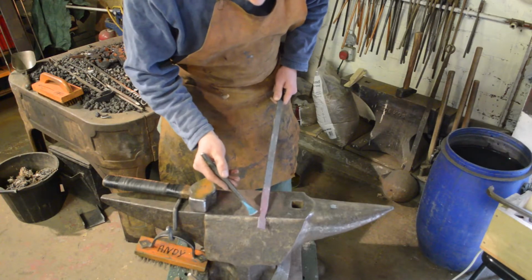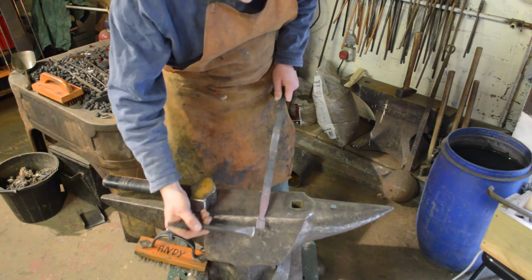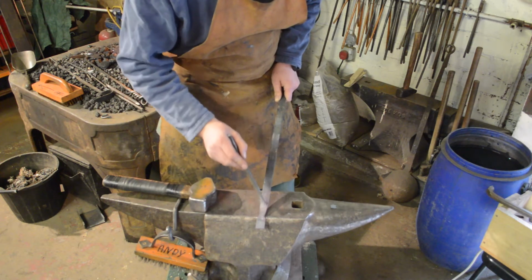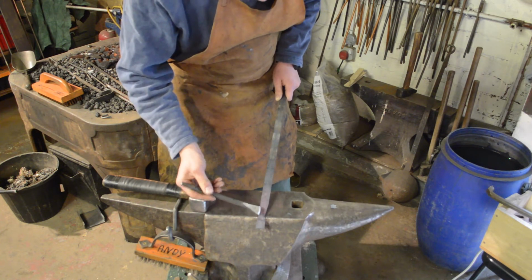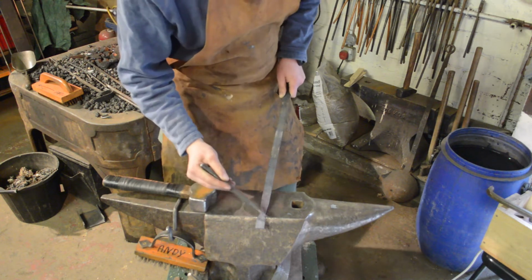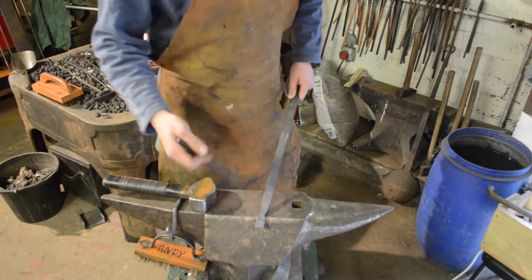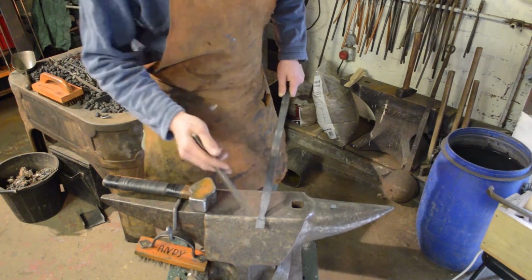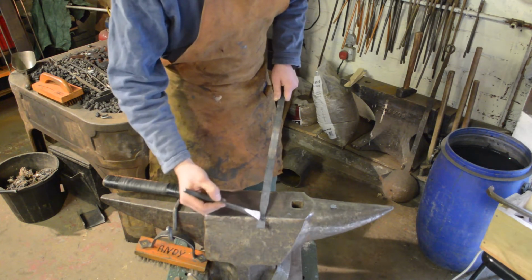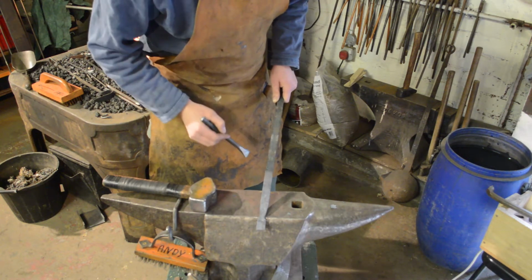Okay, so we've forged the shoulders, if you like, which will become part of the tongs. We've isolated enough material for the prongs themselves. Now we'll go back and draw around the handle. I want that to be approximately 8 mil where the transition is. I don't know what that is in inches, a number of 16ths, I don't know. So we'll draw all this out, and then we'll come back, split the prongs, and then we'll finish up the handle as well.